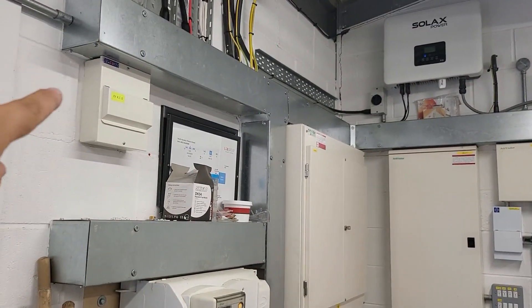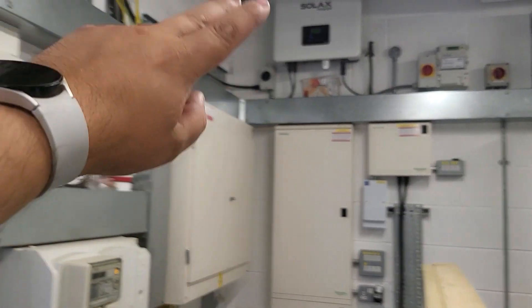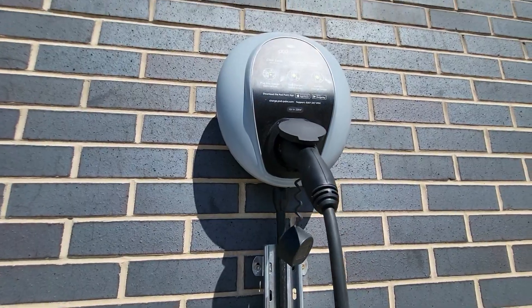The plant room is all sorted. We've got a little board up there with four-pole RCDs and MCBs in, feeding down into the board and outside as described. We're just going to zoom out now, sort the batteries in the MFT Pro, and go through the test procedure to see how the Pod Points handle interrogation from the TIS MFT Pro Plus.